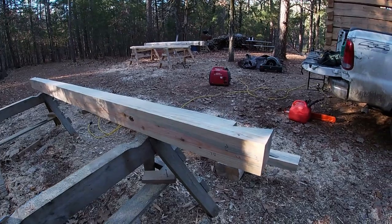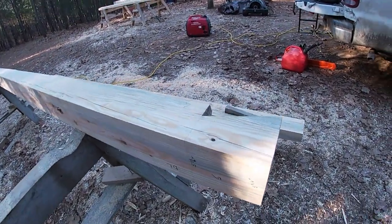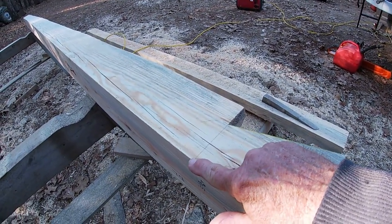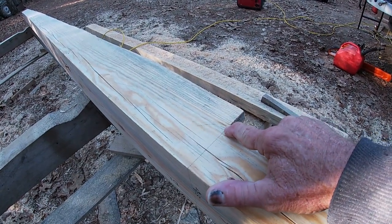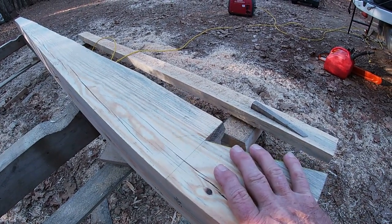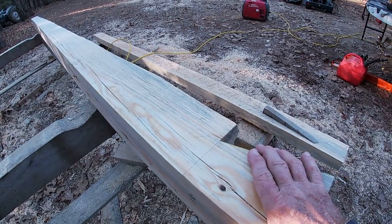There's kind of a keyway notch on the bottom, but I've done just the bottom part of a half dovetail and I left myself three inches from the top side of it where it's flat down to where the notch begins. I'll have a good substantial amount of wood there left on this to lock the top part of the plate logs.